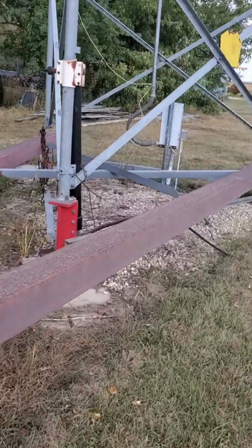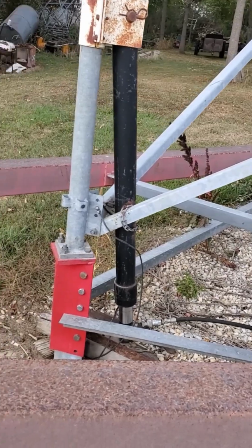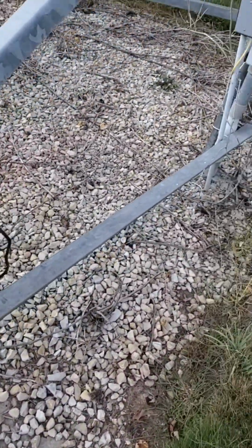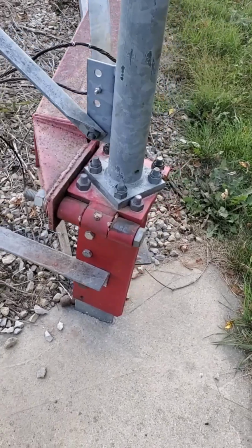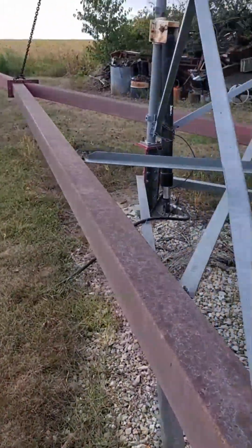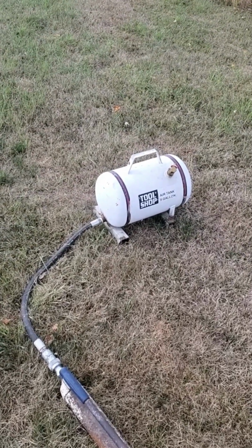Over here we have a hydraulic cylinder. That's my tipping cylinder that we'll use to get this unit started to tip. And we'll be taking all the bolts out. We've got hinges on the back side here that I fabricated many years ago. We've got grease zerks on those. There's my cutoff switch. Here is the other hinge that I produced, and over here we have a line running from the hydraulic cylinder over to a hand pumped porta power cylinder and an oil storage tank.